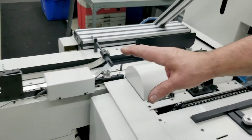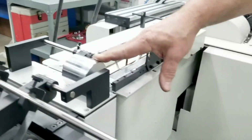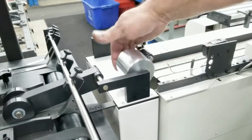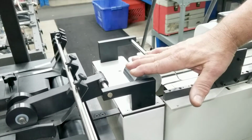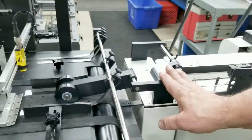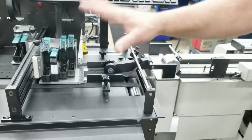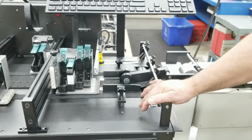We also put a sealer ejector on the machine. This is our unit that we build. This actually helps to seal the envelope down. It's got a weight roller, easy to clean, seals the envelope flap down, and also transitions the envelope from the inserter, hands it off to the inkjet. Had we not had an inkjet in here, it could hand it out to the conveyor, and so it stacks better.